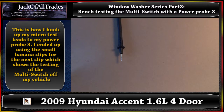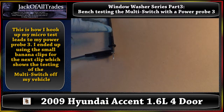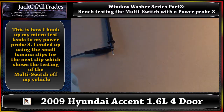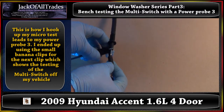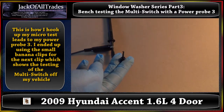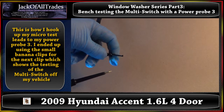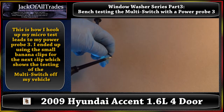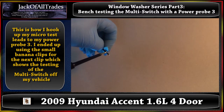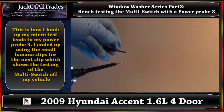So now we're going to hook up our power probe to our test leads. We're going to make this simple — this is the ground lead to the power probe. It's going to hook up to the DVOM test lead. This isn't plugged in; we're just using this metal piece, because these type of adapters require that you fit them in here just like this, and push them in. Now you can hook that in and that leads up to the pins. As for the power probe tip, we're going to probe each of the pins to run our tests. Let's run a test here to see if this will actually work. There you go — that's going to help me run my tests on the switch.